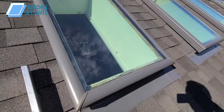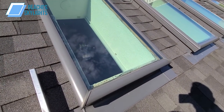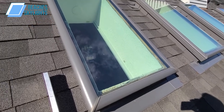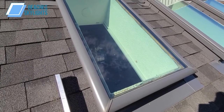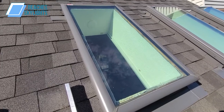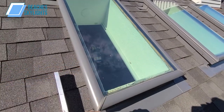Should be fairly simple. The only thing we've got to double-check is the inside drywall measurement. For anybody out there doing the same thing, the inside drywall dimension has to be 21 and a half by 45 and a half inches. If it's any smaller than that — like 44 and a half, for example, like what I'm about to run into today — I'm going to use a multi-tool and trim out some drywall at either the high side or the low side.